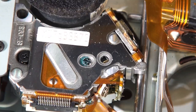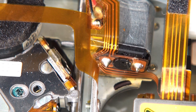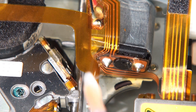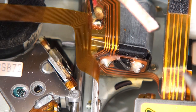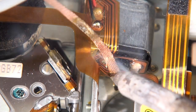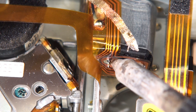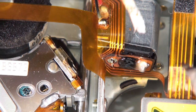Welcome back if you fast-forwarded. We've got the motor and the solder wick. What you could do — and I want to because I'm addicted to flux — is put a little bit of flux on there just to make things flow smoothly, then apply the heat on the ribbon and hoover up the solder out of that joint. You can see that sucky action going on. If you value your Bose, you might want to do this carefully.